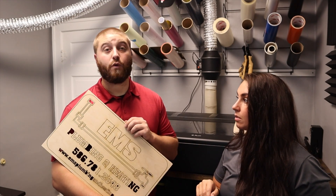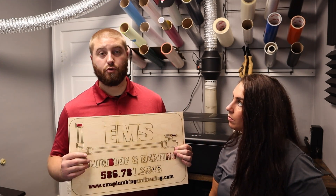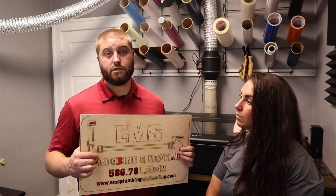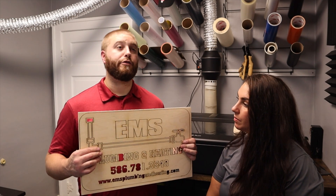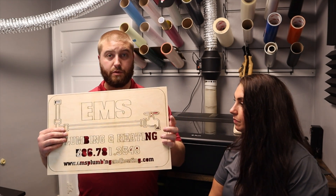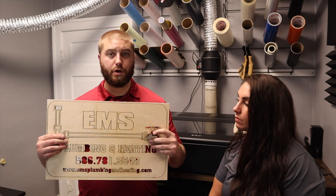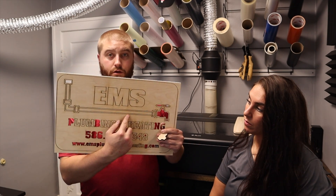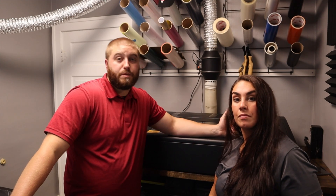This was done with four passes at multiple speeds and power settings — we ran it at 55% power, 60% power, and at 3mm and 4mm per second. You can see some of it broke loose where I could pop pieces out, but then the center is completely solid. It comes down to spending $5,000 on a machine that has put us five weeks behind.